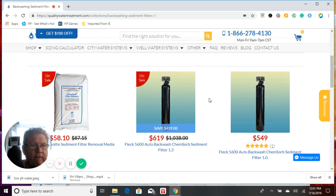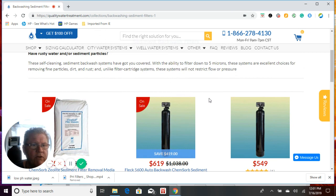It just backwashes itself out. You usually set these to backwash every day to every 3 days minimum, to backwash what is taken out down to 5 microns. It just backwashes with plain water. You set them up to backwash every 4 days by pushing every 4th pin up on your 12-day pinwheel. There is no other maintenance involved on these.